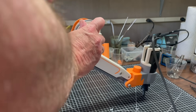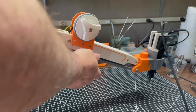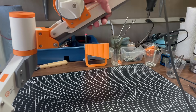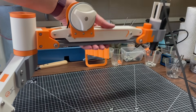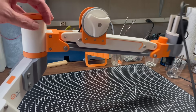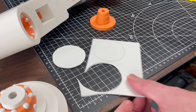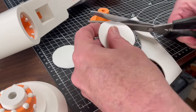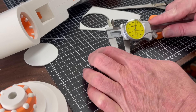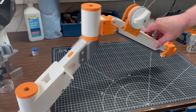This time, when the bungee cord had reached the limit of how much it was able to stretch, there was just enough torque to counterbalance the tool. Once off the table, the arm went all over the place — the bearings might work a little too well. I quickly fashioned gaskets from 2mm craft foam to add a little friction, and that helped the arm hold its position a lot better.